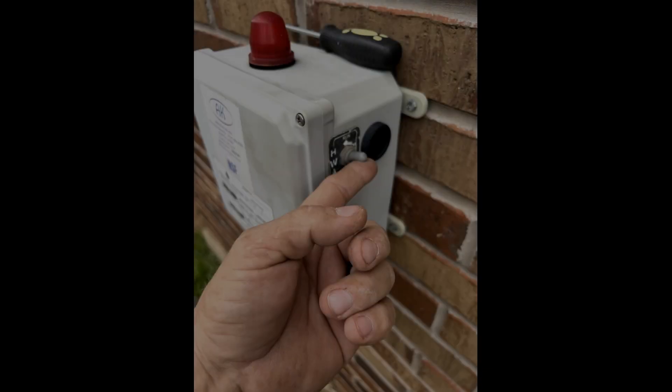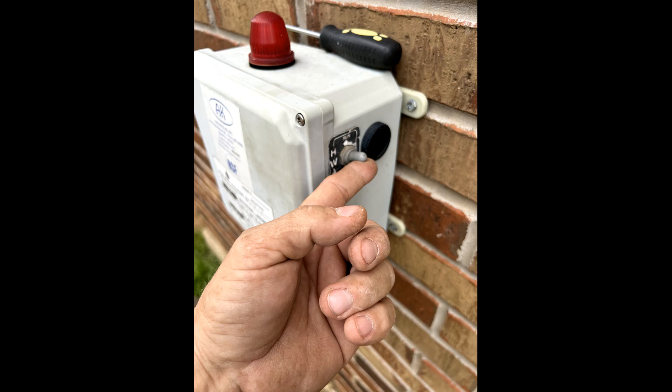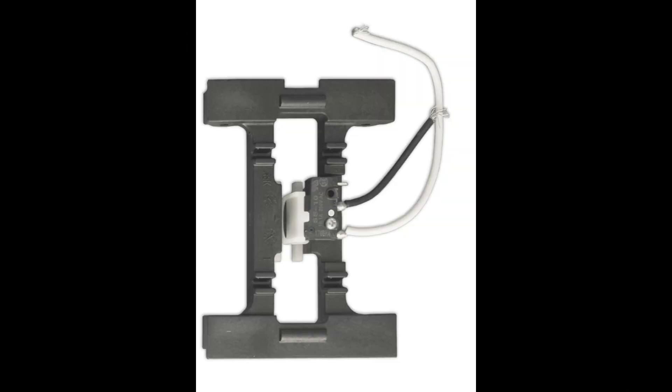And finally, don't forget to place the alarm switch back into run mode. As I stated at the beginning of the video, there is one exception to the rebuild that you will encounter from time to time, and that is a unit that utilizes the newer SP micro switch as opposed to the plastic screw and nut. On a disabled unit you will see a small orange nipple between the switch and the slide. Once the new diaphragms are in place, simply push the slide until it depresses the nipple back into the micro switch housing. This will then allow the unit to be powered.